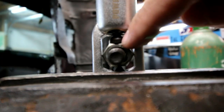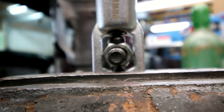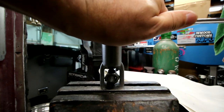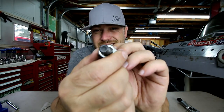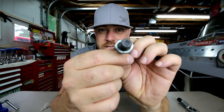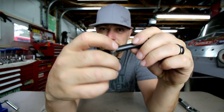You can see it's already starting to oblong the nut — kind of squish it. The cutter on the bottom is already penetrating that nut pretty well. Well, that worked. You can see that wedge just kind of split it along the top. It didn't split it exactly all the way through — there's still a little bit of material hanging on. But what it did do when it split it, it kind of spread it apart. If this was a bolt or nut that was rusted on, it would kind of break it free from the threads where you could get it off.